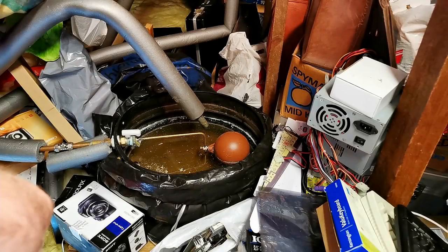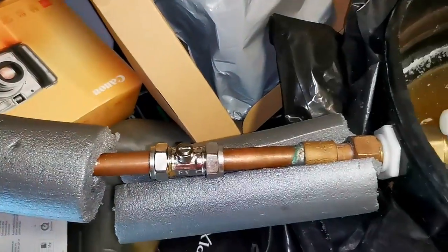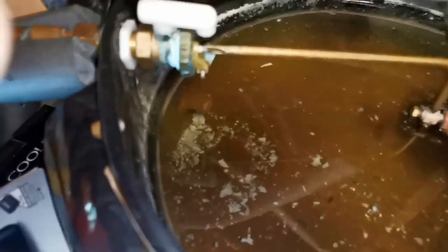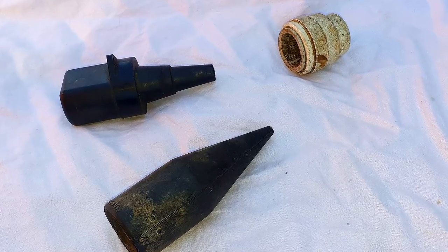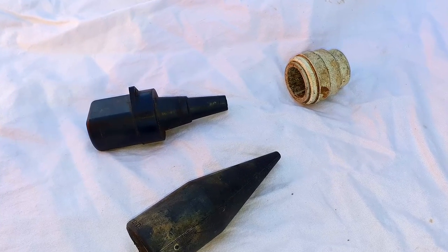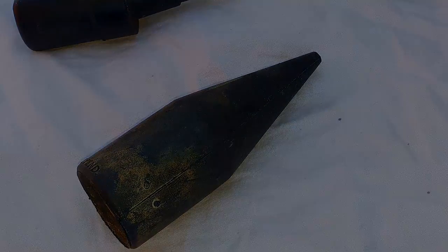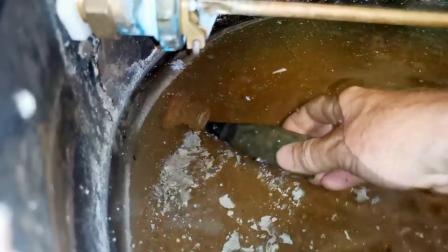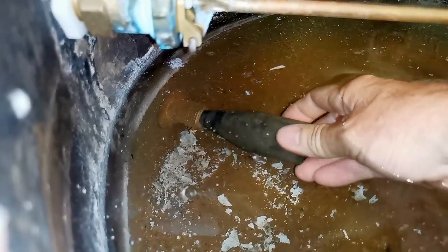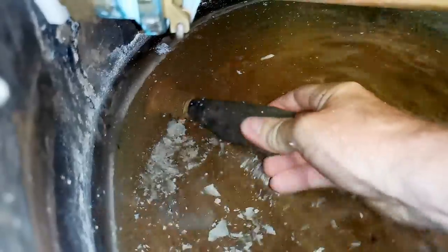Now I'm going to show you how to bung up this tank — this was the tank where I replaced the central heating pump valves. Just here is the mains cold water supply pipe that keeps your central heating topped up, going into the float valve, and down in the bottom is the cold water feed pipe which feeds the central heating. Here are the two rubber bungs I normally use, plus a 22mm speed fit cap. If you're going to get yourself a bung, try and get one where the taper is a continuous taper rather than one which has a step in it — the continuous taper fits just that little bit better. So this is the feed pipe and I want to bung that up to stop any water from going into the central heating system. Here's my bung — I'm going to push it into the hole there and then give it a little twist and make sure it's not going to come out. Push it in there nice and tight.